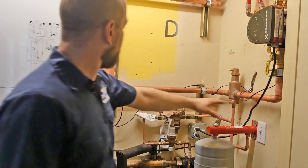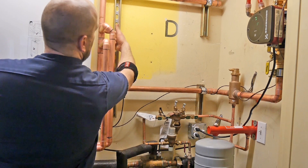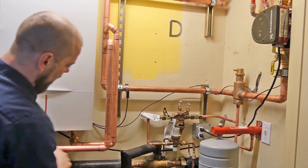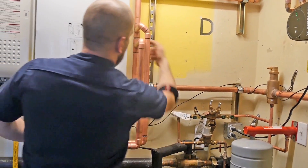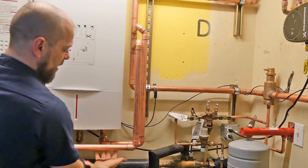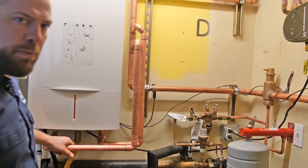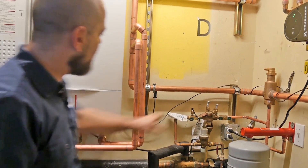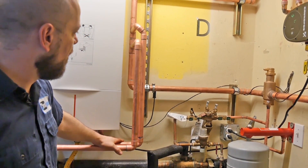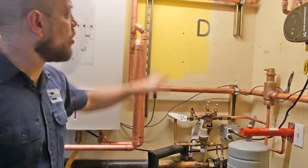This is primary-secondary piping. Off the boiler we've got our lines coming up with closely spaced tees right here. The hot supply comes up, this loop pulls what it needs up through the system, comes back, and returns on this line. Bosch has also got a sensor placed downstream, which is pretty ingenious — it's sensing the mixed temperature here as opposed to just the supply and return at the boiler, so it can ramp the boiler up to get the temperature we need.